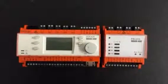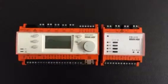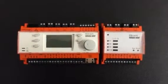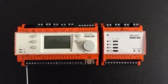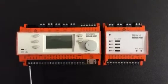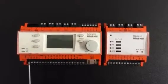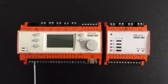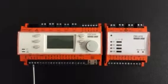Hello, it's a short video on the field bus module side of the DDC420. We use field bus modules to expand the input and output capability when we're planning our projects. The field bus modules are connected on the field bus connections where we have four terminal connections for our cable. This is normally a two-pair screened twisted pair cable, which allows us to derive the 12 volt DC power supply for the field bus modules to operate, and then we have the two cores which are the communications for the CAN bus.